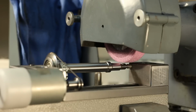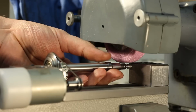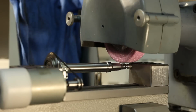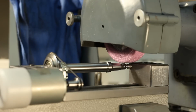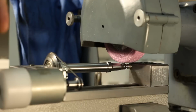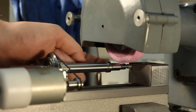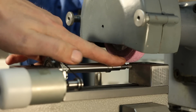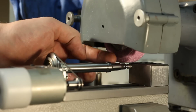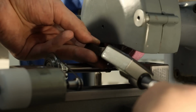Okay, this should be pretty much to final diameter, and the part, I let it cool down for the last pass. It's not even warm to the touch. This is pretty much at room temperature. So let's take a measurement. And you saw me also move up the grinding wheel against the shoulder. The grinding wheel has a dressed side, so I touched up the register surface here of this step.